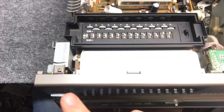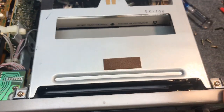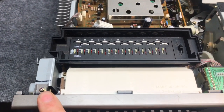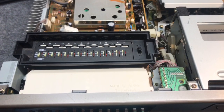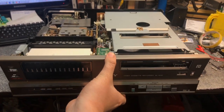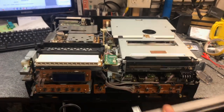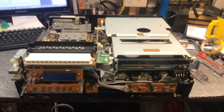Here are the screws to take the front panel off — you have a screw here, a screw here, and a screw here. When you take these off, there are little metal pieces — they're reinforcements. Don't lose those. And when you put them back on, do not over-tighten them because you'll bust the plastic. Screws are removed; now it should just come right off — kind of hard to do with one hand. And then you bash the counter with it. Anyway, now we'll go back to the bottom.